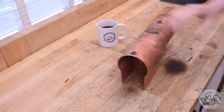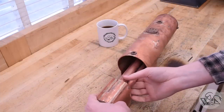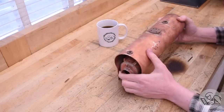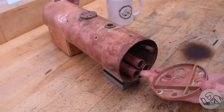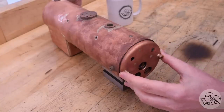To do that I'm going to start with the outer shell here — the barrel on the outer crown sheet — and then I'm going to slide the inner firebox in there and mock everything up, because for the next few steps we need to make a bunch of pieces with everything in its final resting position. It's important to get the front tube sheet in place as well to make sure that the fire tubes are sitting in the correct place, as they kind of flop around left to their own devices.